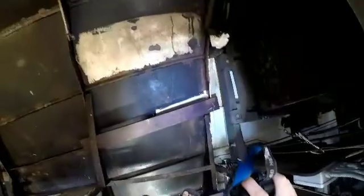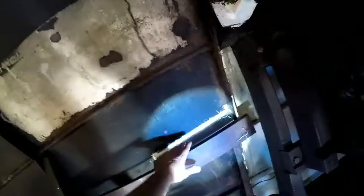So just here is where I discovered a thin spot. Basically the rust was really hard when I was chipping at it, and I chipped around the edges and then it got wet, so I stopped chipping at it. I've drilled holes in the bulkheads to the fore and aft of it, and put a bit of timber there and packed it up with other timber, lock wired it down, and I've got some basically gap filler. It's hopefully not going to be too difficult to get back out. When next time I slip it, I'll cut it out and weld some new steel in there.